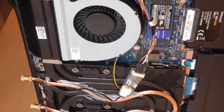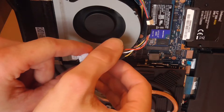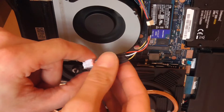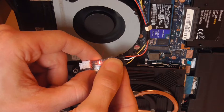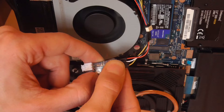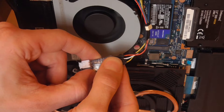To set the controller, switch on the laptop. LED2 should light up on the controller. Slowly double-click in succession to reduce the speed of the fan until it stops and does not rotate. Then press the button once and the fan should start spinning. Then do not press the button and wait for 20 seconds. The LEDs will flash. If LED2 lights up permanently, the idle speed is now programmed.